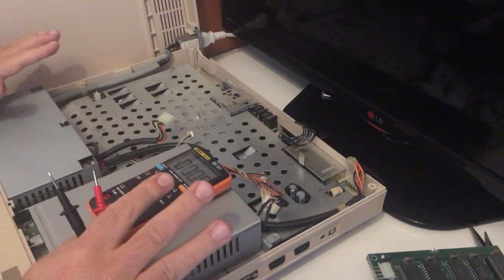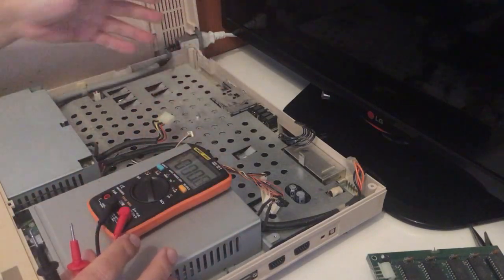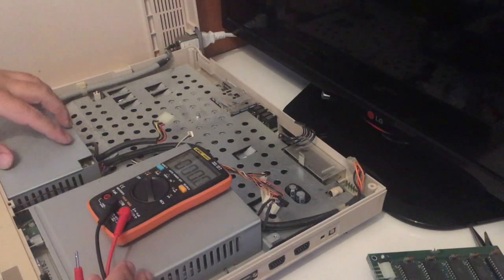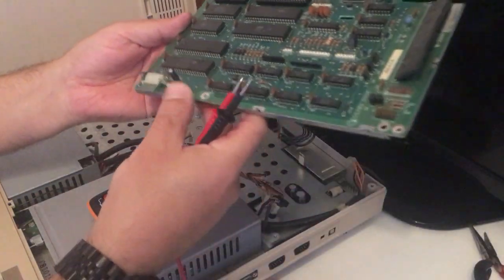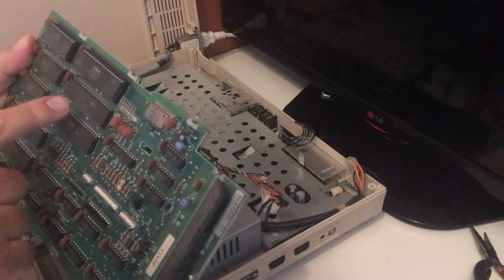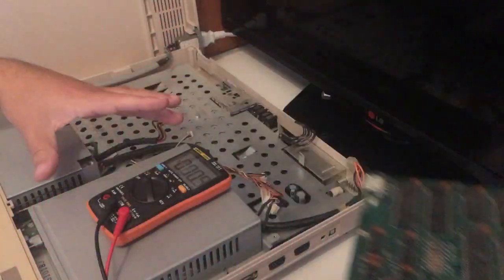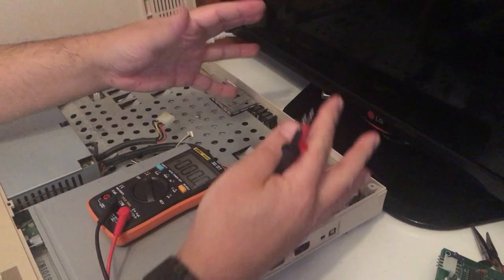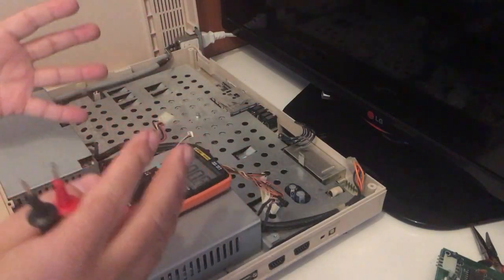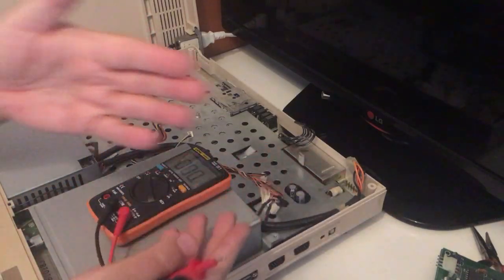We have opened the 128D — it hasn't been open for 20 or 30 years. You can see the dust. It's a standard 128D board. Here we have the built-in PSU, here we have the floppy drive built in, and the controller for the floppy drive over here. These chips — the 6526 CIA chip is from the 21st week of 1986. The 6502 on the floppy drives had their own computer system boards built in — that's why a 1541 floppy drive cost the same amount as a Commodore 64 back then.